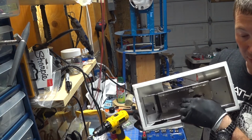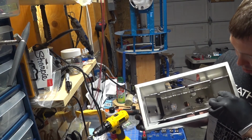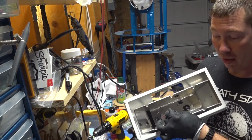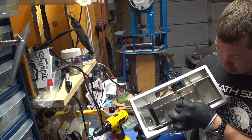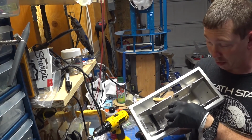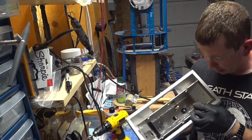So this is the new bolt. There's now 4 bolts that come through. This one and this one, I actually tapped into the Vex and Q85 bracket, as well as through the ankle plate, as well as through the foot shell. So there's no nut because all 3 of those pieces of metal have been threaded exactly to that thread size.